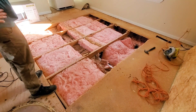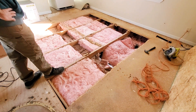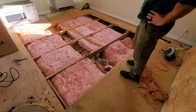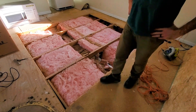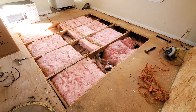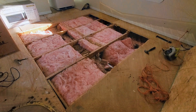So it works decently with the drill as long as you don't zip it down really quickly. My running watts are 280 and my starting watts are over that 600. I've got the floor cut out. All I need to do now is clean up the floor joists on the crawl space, add some insulation where it's falling down, clean up the edges, and then get it put back down — and I'll be ready for carpet. That carpet right there was actually in our living room on our off-grid build, and I'm going to repurpose it here.